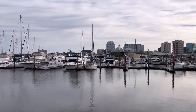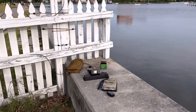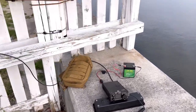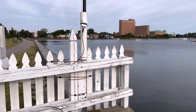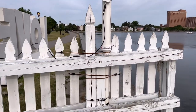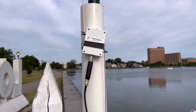Here's the setup. That's Norfolk over there — Norfolk, Virginia. I'm in Portsmouth, Virginia. This is a marina here on the Portsmouth side. For those who know the area, that's a US Naval Hospital. I'm going to be using my Xiegu G90 along with my 6 amp-hour LiFePO4 battery. I used some bungee cords and a piece of PVC pipe — 2-inch OD at the bottom with a reducer up to 3-inch. I use it at the beach all the time, but bungee cords are amazing and I've got it into the fence here. There's the 49:1 unun from Tennas, and I do have a choke on it.